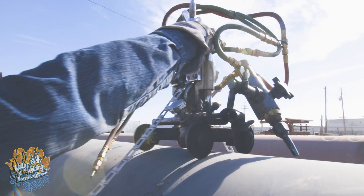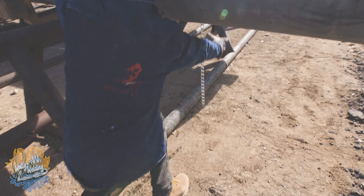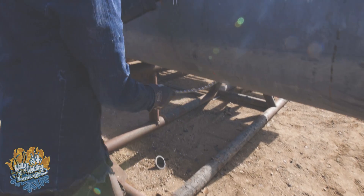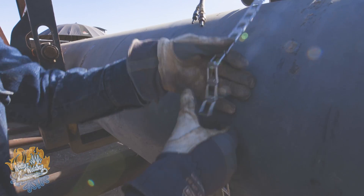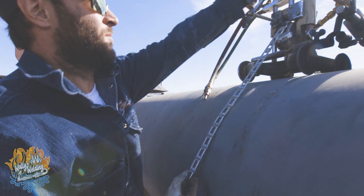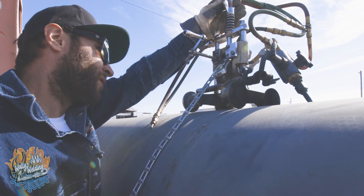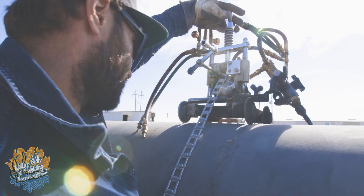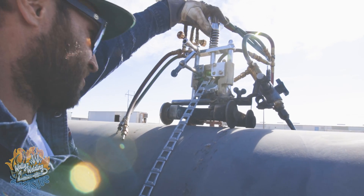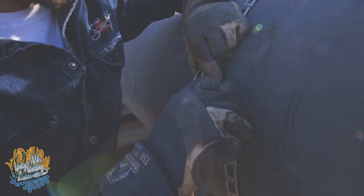Now when you lock it, make sure you have a firm grip on this up here with a slight tilt of it backwards. Don't have it too forward because it'll come forward. That way you can reach under the pipe and grab your chain and bring it to where you need to adjust. Be real careful with this. I need to take this down a lot in order for this chain to go to work properly. So I have to back it off almost to where my gear is touching my bar down here. I need as much slack as I can in order to get this chain to fit properly.